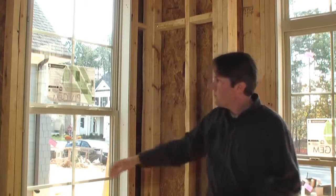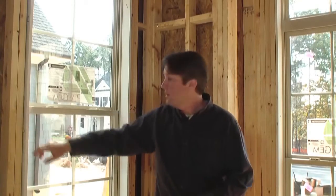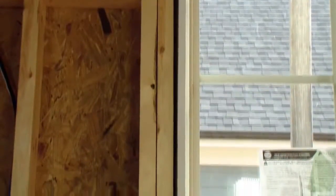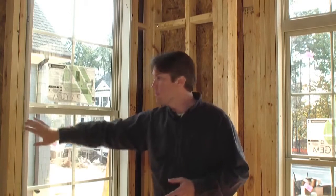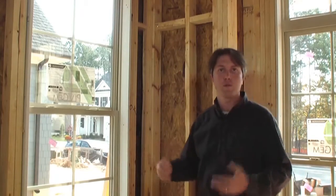We also have a window with a small crack between the window and the rough framing. This crack can be filled with multiple appropriate products. For small cracks, you may want to use caulk. For larger cracks like this, a minimal expanding foam works really well. If it's a really large crack, you may want to backfill it with insulation and then seal over the top with an air barrier. The important piece is ensuring that you have an air barrier in place to stop airflow around the window.